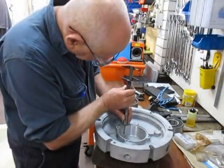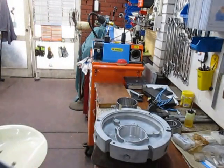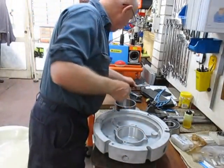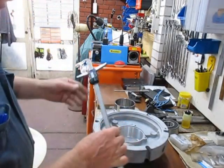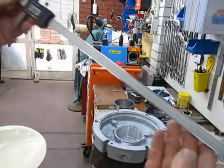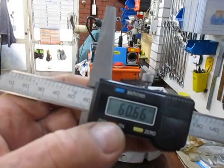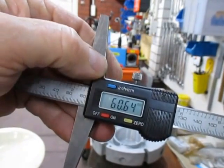We also need to measure the depth so we know how thick to make the bush and how much to cut it off. One option is to use the vernier and measure from the heel to the toe of the slide. My preferred option for depth wherever I can is to use this digital depth gauge, which reads up to 500 millimetres or 20 inches. You can switch between millimetres and inches — in this case that's 2.3875 inches or 60.64 millimetres.